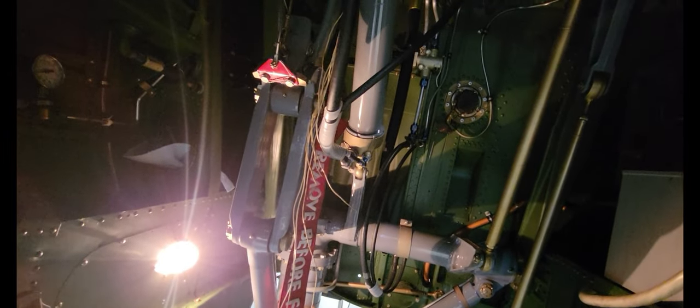There were portions of this that I didn't realize the mic had shut off and run out of battery or whatever. What I'm talking about here is walking into the wheel well and being able to turn on a hot bus, which will allow us to have lights in the wheel wells and a light for the crew as they walk in, so we can see what we're doing without having to turn the batteries on the aircraft.